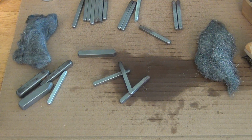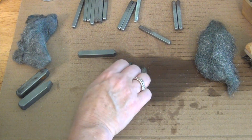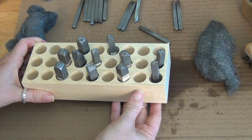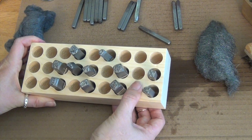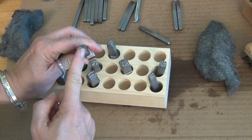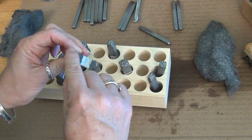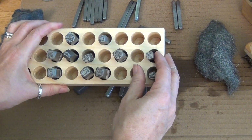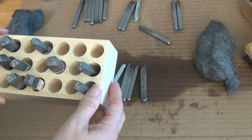But I just wanted to mention, depending on the size of your letter set, you're going to want to compare the size of the shank, and it's in the product description, and compare that to the product specs on the holders to make sure it will be a right match, because some stamps are a little bigger. Some makes are 1/4 inch shank, so just make sure they match up. That makes sense. Yeah, and do we have what size fits in there in the description? I have to look and see. I think it's just the inch or millimeters. As I mentioned, you need to worry about the diameter measurement of your tool to see if it will fit in a certain size hole. Like this is 1/2 inch, but it might be longer if you look at it not from the diameter, but the cross, diagonal. That's the word I'm looking for. But this certain holder that we will put a link up to holds 1/2 inch and 3/8 and smaller. And smaller, right. Yeah, just not a big one.